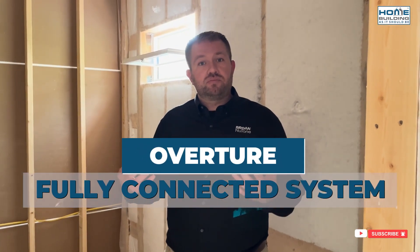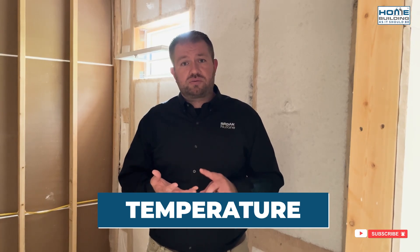Maybe you can quickly talk about the Overture system as well. Overture is a fully connected system within the home for ventilation. If we were to use a exhaust fan in a different area of the house, with Overture we can sense humidity, we can sense tVOCs, temperature, as well as CO2, and act upon that. If you have ventilation devices like an exhaust fan, an ERV, or a kitchen range hood, this whole system of hardware — whether it's a wall control, a room sensor, or a smart plug that the ERV plugs into — can respond to indoor air quality events. High humidity for whatever reason, those sensors pick up on that and have dedicated ventilation devices react, boosting up the ERV or turning on the kitchen range hood if someone's not running it themselves.